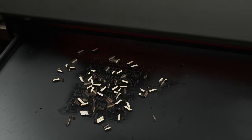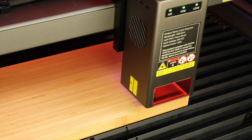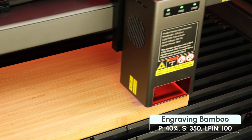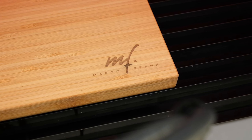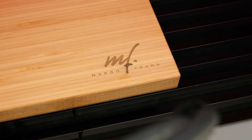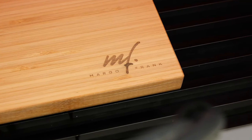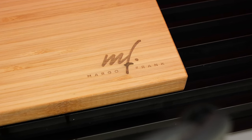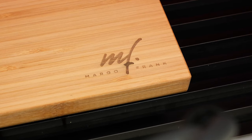While this is engraving, let's check out Creality's access drawer below the laser. The drawer easily slides out and lets us clean up any debris left over from previous jobs. With other lasers, it can be tricky to work around the gantry and laser head, but this makes cleanup nice and quick. The engraving turned out great, and we can see how much detail the 22-watt module provides. However, if we look closely, we can see that with these settings, the Falcon 2 Pro struggled a bit with the letter F, since part of it is missing. This would probably be easily resolved by dropping down the speed a bit. Overall, we're very happy with this, because bamboo can be a bit tricky to engrave.